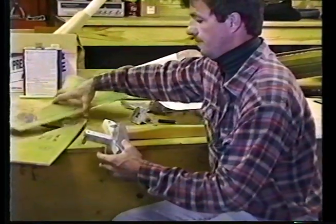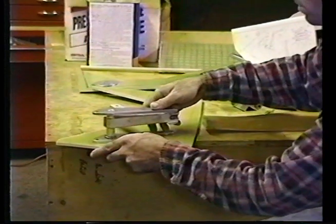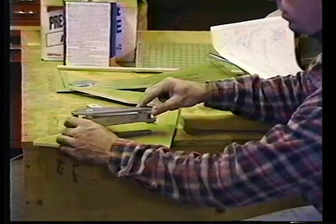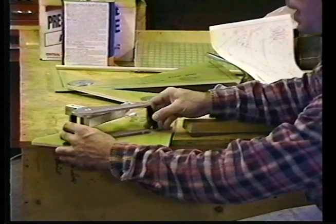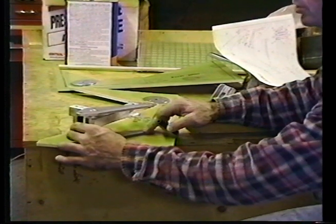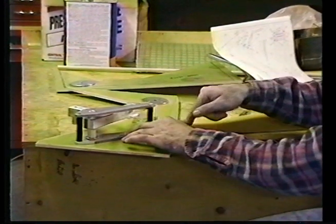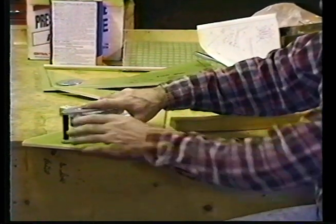This is placed directly over the holes that are pre-drilled through the phenolics and through the layups. You're provided with two aluminum bushings that are 2.5 inches in length. The bolts pass through the NG30, through the plate, through the compression bushing, through the opposing plate, and then through the other side of the NG30. After you've done all your pre-sanding, you can bolt all this stuff together in preparation for fitting to the fuselage.